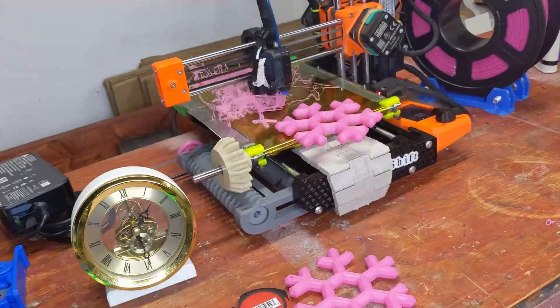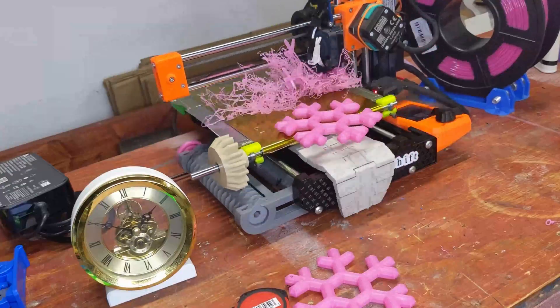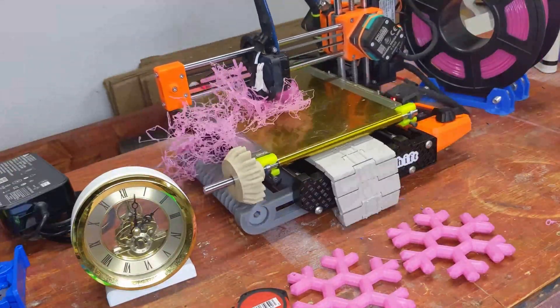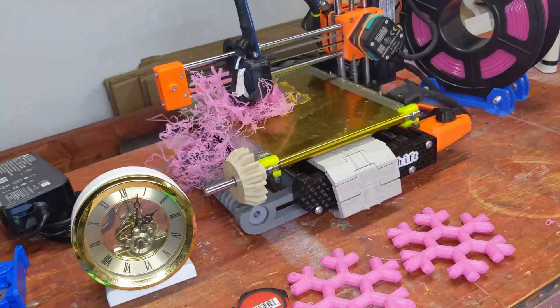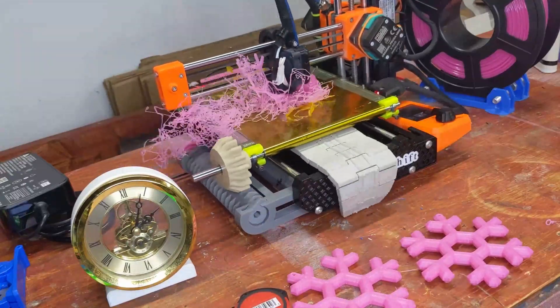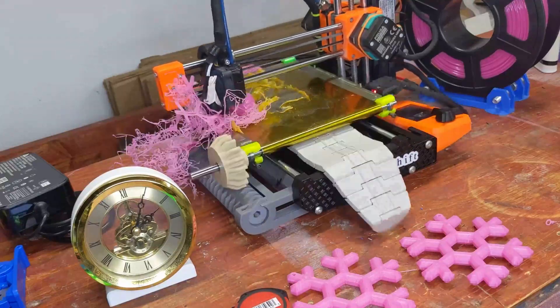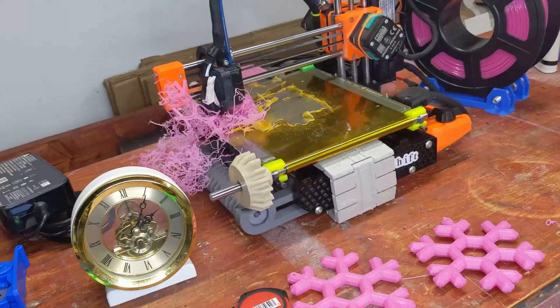This particular blob is coming up. I've been tweaking the auto-retractor on the belt ejection module, and while I thought I had it working pretty well, it clearly failed to eject here. I really need a day or two to sit near the machine and observe how it's working, but life's been pretty busy lately. It took me a little longer than it should have to remember that I can just record timelapses and watch them after the fact to see what failed. Ejection fail, and the next print starts the angry spaghetti.